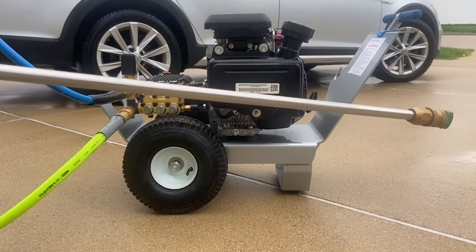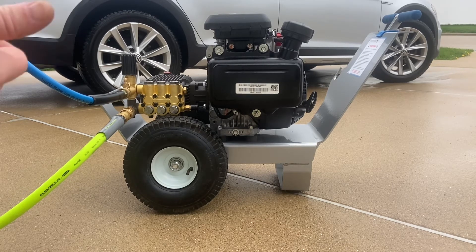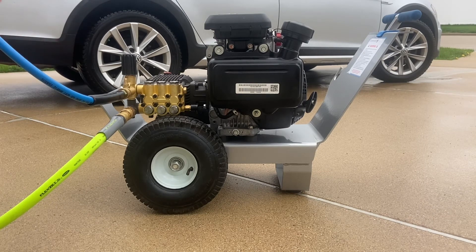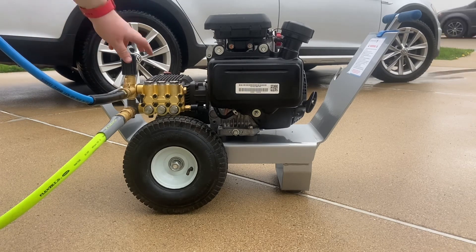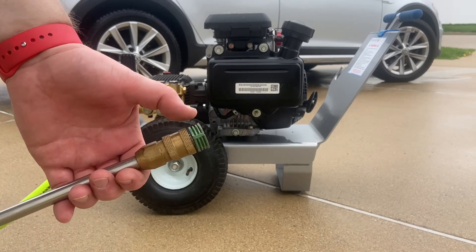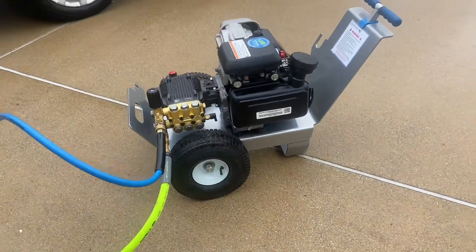It seems to work great — pretty happy with this pump replacement. This motor is 190cc and you can put it on any three-quarter shaft motor: Honda GX200, GX160, Subaru SP170, Subaru SP210, Briggs and Stratton — anything with a three-quarter shaft at about five-and-a-half to seven horsepower. You may need to adjust the unloader or increase the orifice size on your nozzle. Hope you enjoyed the cam pump installation!